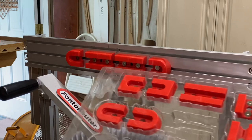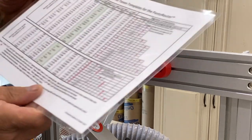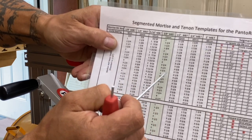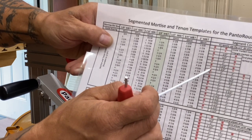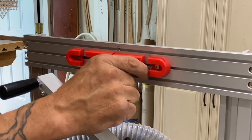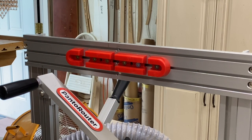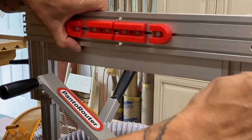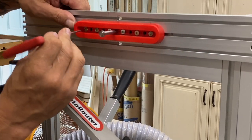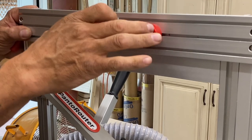That is flat. So I'm using this segmented mortise-and-tenon template kit on the pantorouter and I love this thing — it's super easy to set up. I'm going to be cutting a half-inch mortise and tenon. I want a mortise and tenon that are three and an eighth inches, so I need one template marked with a circle on each end and two marked one inch, since it's a two-to-one ratio — meaning those combined give me the three and an eighth mortise and tenon. To put them in place, I bring them toward the center, use one in the center to auto-magically center everything, and tighten them up — boom, that easy.